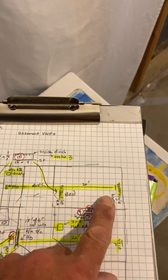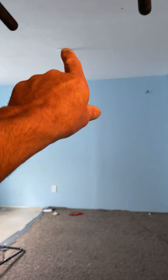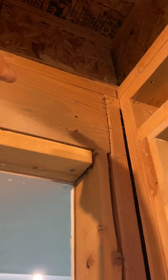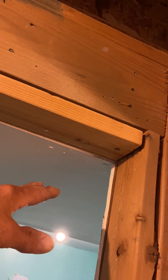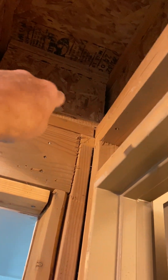In this bedroom there's a 4x10 over here, and it's going to have to go in this bay right here. In this room you'll probably have to cut out some sheetrock and cut out the bottom of the duct — I gave you a 16 by 16 patch. Then cut a top takeoff out of the top. Chances are you'll be able to knock out this header and do all this from the top without cutting sheetrock, but I gave you a patch just in case.